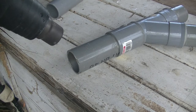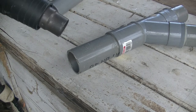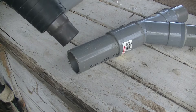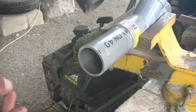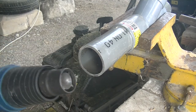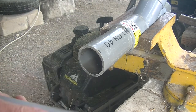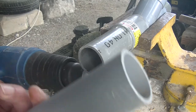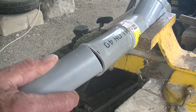I've got a hot air gun — just got to heat that up a little bit. PVC softens at about 70 degrees. After a while you'll see that it will soften so that we can actually bend it with your hands. Then you get a loose piece of pipe, a small piece, and start working it in.